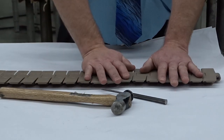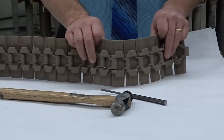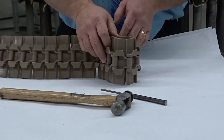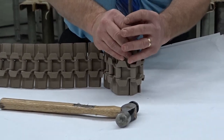What we're going to show here is how to break chain. Every chain has a little bit of difference in how it's done, but I'm going to show you how to do 879 tabletop chain here. That's a common chain. So roll it up and you can see the pin in the back of the chain.